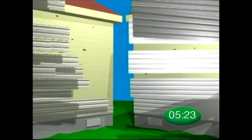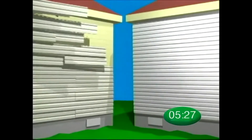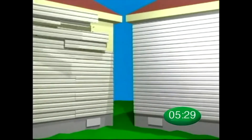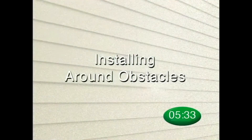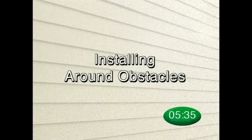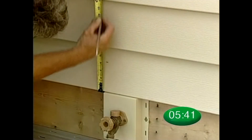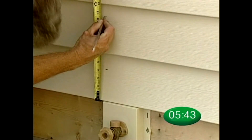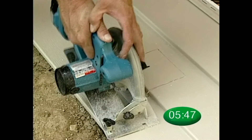You will find that solid core siding goes up the wall much quicker than conventional siding. After a few jobs, you should see significant time savings. As when installing traditional vinyl siding, you will have to work around objects such as spigots and other obstacles. If the obstacle has been J-blocked, simply measure the dimensions and cut the proper clearance out of the siding panel.